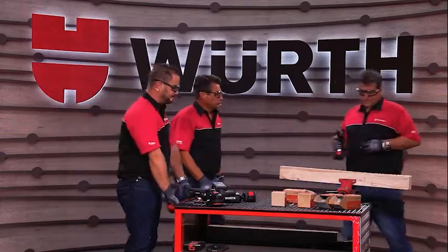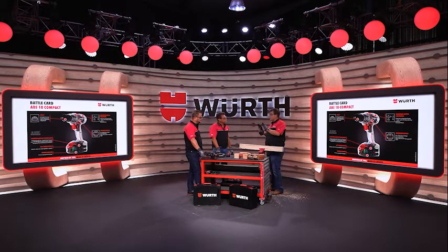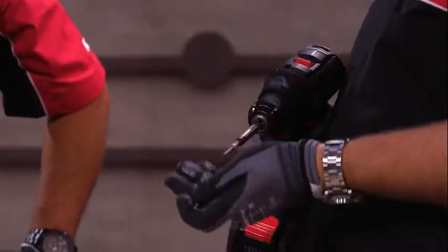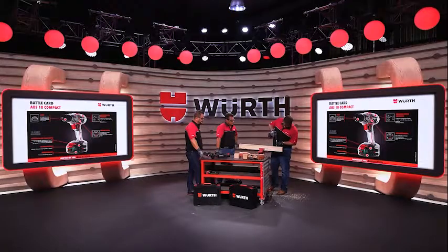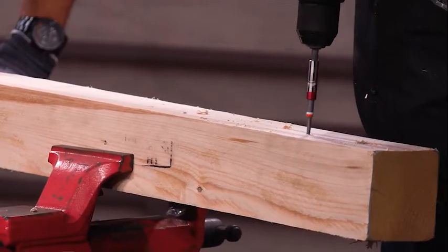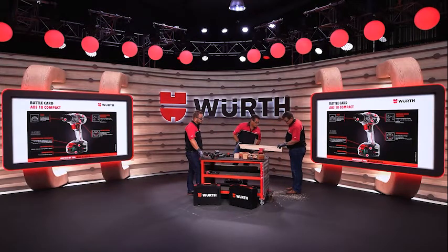I think the benefit for the customers using it is the screwing in aspect of things. And this is where this torque setting is so good. I can actually take a screw and put it in at whatever level I want it to go in. Let's have a look here. Let's run it on an 11. Let's see what happens. That gives you a nice drill into the surface, just slightly below the surface. Slightly under flush.